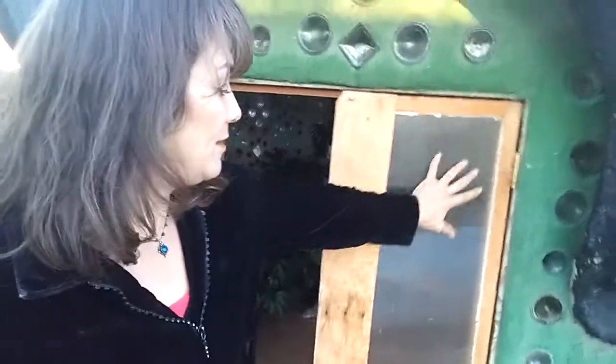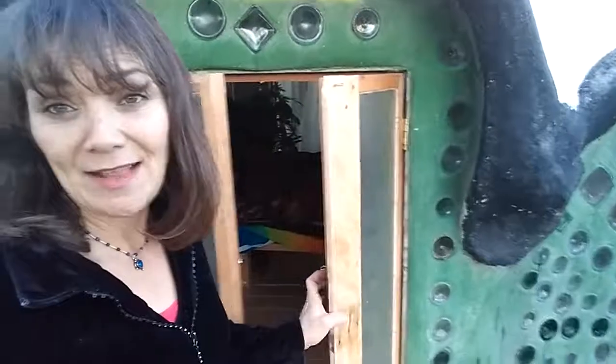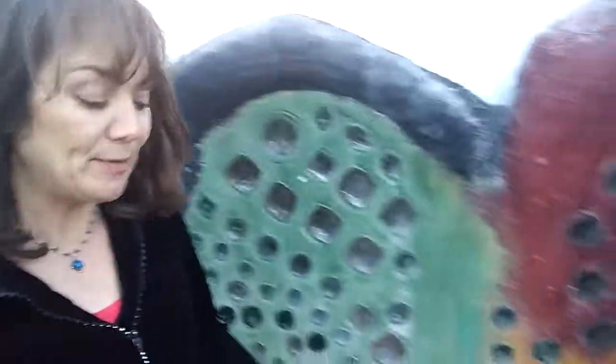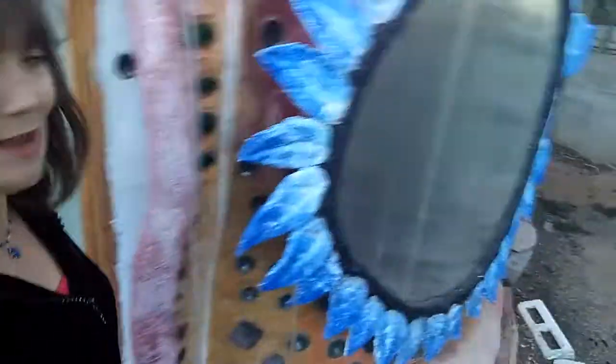This is a certain kind that's double-paned and corrugated — it lets 85% UV through, and it's like better than double-paned glass as far as efficiency. I think it was about $70 for an 8x4 sheet. I ended up buying two or three sheets for this project because each of the big eyes took a whole sheet with just a little scraps left over because of the big size of them.